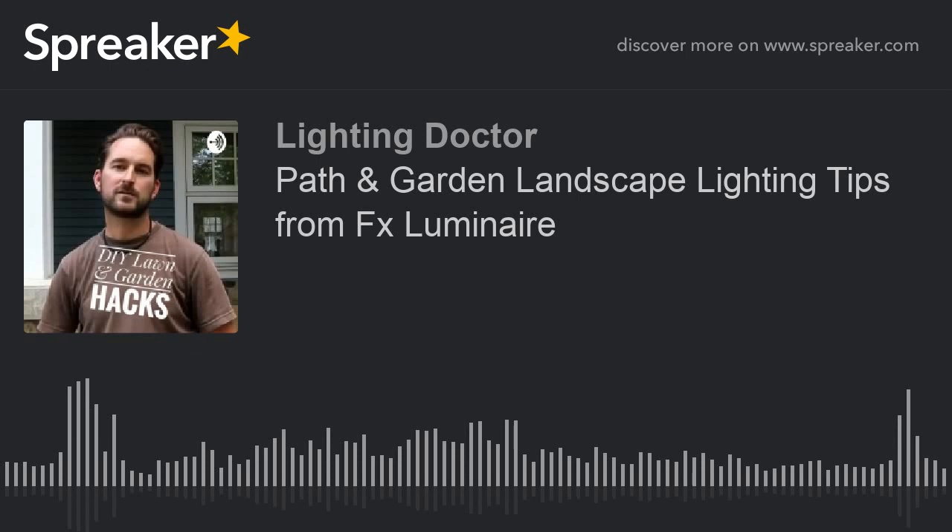We focused in on the driveway using those posts. We staggered the posts and used the DE down lights all along this area, giving a nice wash effect across the driveway. It's a very wide driveway and a typical directional path light would not cover that length — the DE down light gives a very wide spread and washes the entire pathway. At night it looks fantastic with the stagger, and we were really happy with the way it turned out.